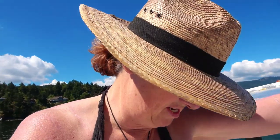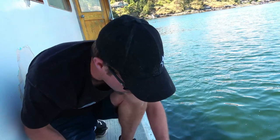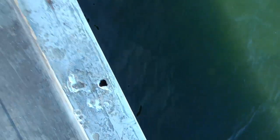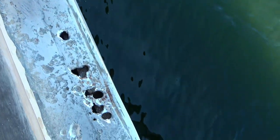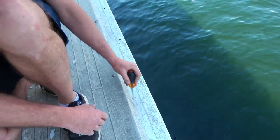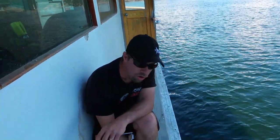Aluminum — and stainless too — can get what's called intergranular corrosion. You'll see a little pit, but it'll go through and weave its way in between the top and bottom surfaces of the aluminum. Here's one spot I just tapped with my hammer and it went right through because it just worked its way right through. Now I'm doing a little bit of dentistry, exploring all the spots to make sure there are no other spots that are all the way through that I need to fix.